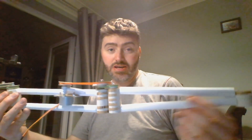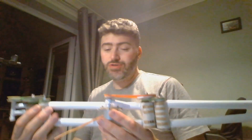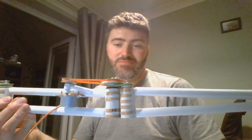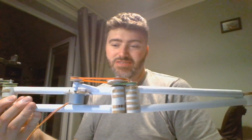What I made was an antenna robot. Unfortunately, the stepper motors I used — 28BYJ-48 stepper motors — don't really have enough power to move it. At the moment it's pulsing, but as you can see, it's not making any difference. If I take the belt off...